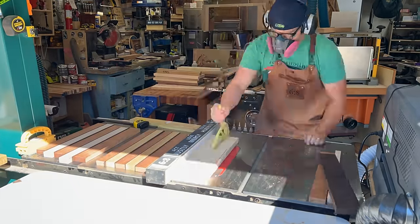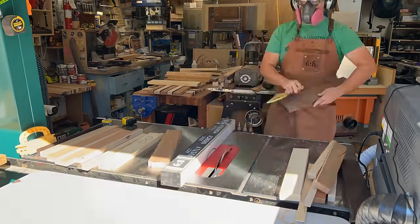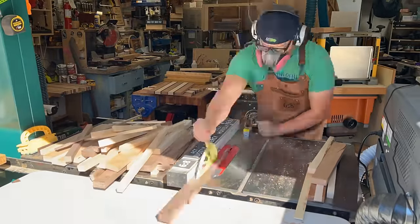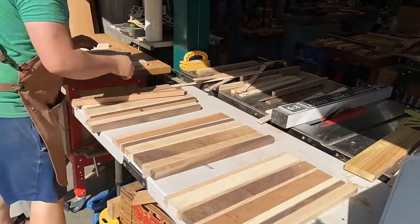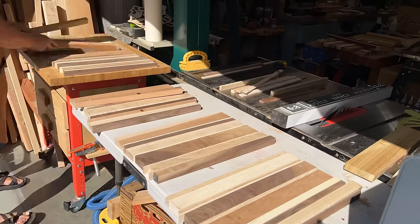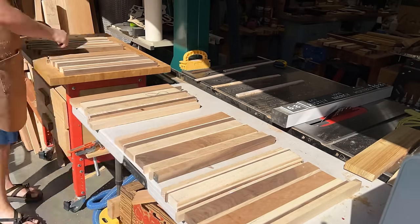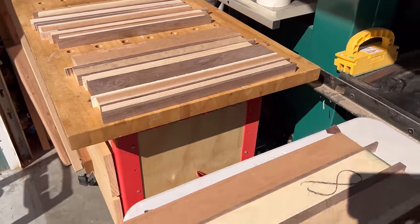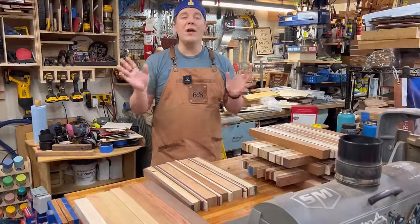Here's a quick look at face grain boards. For these, I'm not cutting to one and a half inches and turning on edge — instead these are all about one inch thick pieces, wider panels. This is a face grain glue-up where I don't rotate the piece at all. I cut a ton of different pieces to different widths. You don't want to mix face grain and edge grain — that accounts for wood movement. You get some pretty cool boards, especially with figured woods like curly maple or quilted maple.